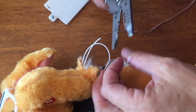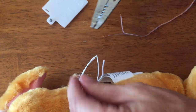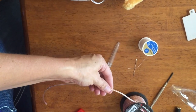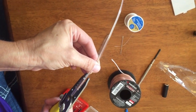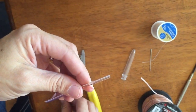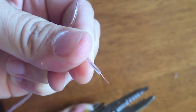We're going to cut each wire here and strip these so they also have exposed wire. We don't know how long we need it, so we're going to cut this and split it on each end. I'm going to start the split here and then separate that wire a little bit, and do that on both sides. The next thing is we're going to strip the end of the wire off so we have a little bit of wire that we can solder to.